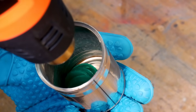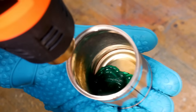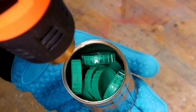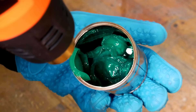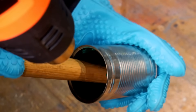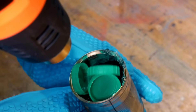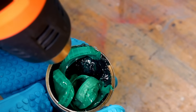Surprisingly enough that heat gun does get pretty hot, so keep your eye on the plastic and then remove the heat once it's melted. We're pushing the plastic down into the tin after each layer is melted before adding more and continuing. It will take a little bit of time to completely fill the mould, so just keep repeating the process until you're at the volume that you want.